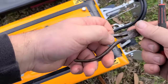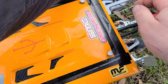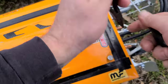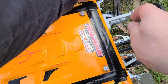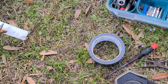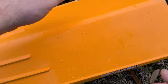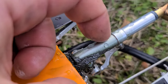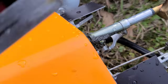Hopefully it's in the shot. I'm going to hold my set nut, go down about one full turn, and then tighten down that set nut. Making that stuffing tube come out longer — farther into the stinger — it didn't prevent losing grease. So that's kind of a bummer.